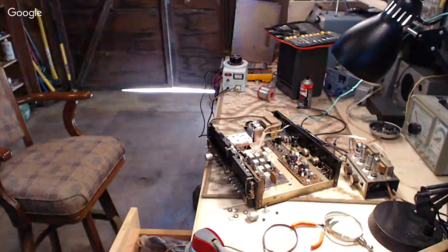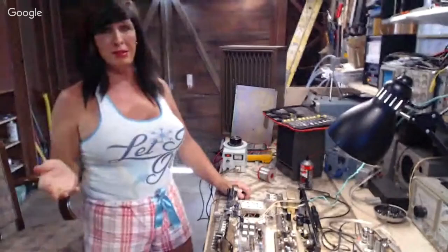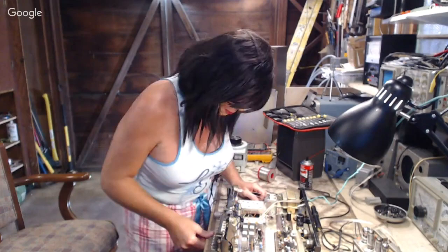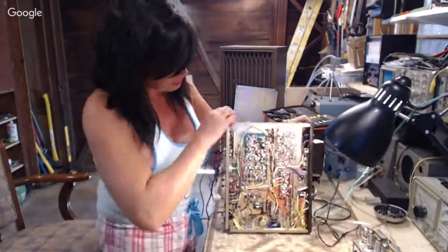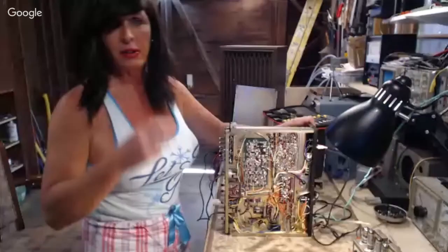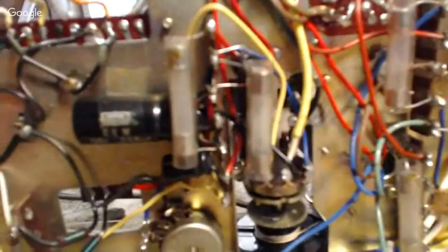Now, lighting is on a whole separate circuit. You find people in life who will turn on their units, they'll get lights, but they won't get anything else, because the lighting is always on a separate circuit. The problem is I don't have my schematic for this unit. And I suspect, guys, that down in this area one of these fuses has cut loose. Remember what I showed you earlier? There are separate sections here that are fused, and I think one of these controls the lighting.